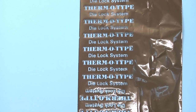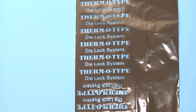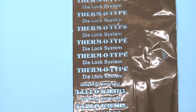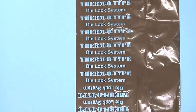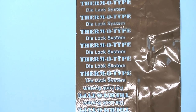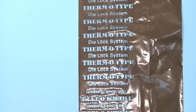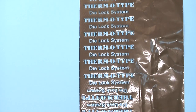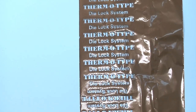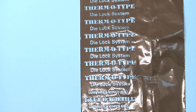With the program running on the machine, you're going to see evenly spaced foil image areas with all the foil between the two image areas being utilized. You can vary the default gap dimension — it was one-tenth of an inch. If you increase the default gap dimension you'll get fewer steps between the images, so you'll get a little less foil utilization but more of a margin between the imprints. This is a very simple and easy-to-use system that very accurately sets the computer up to do long and short foil draw combinations.